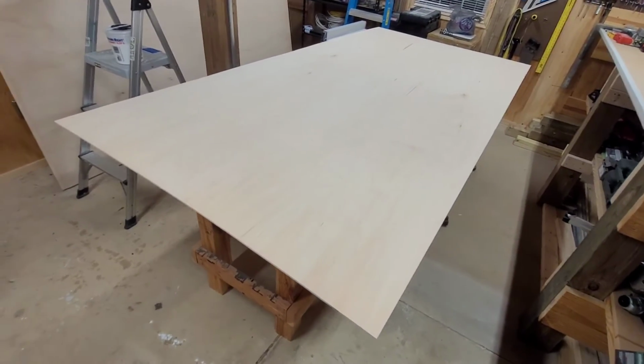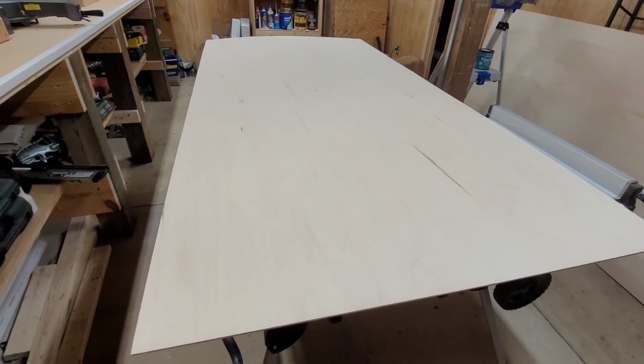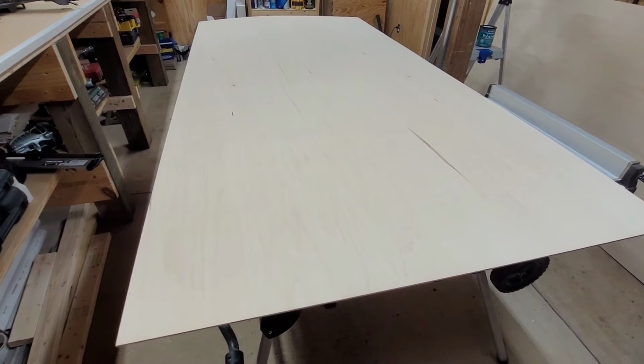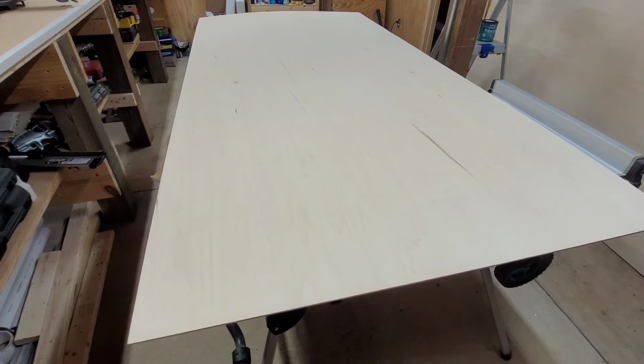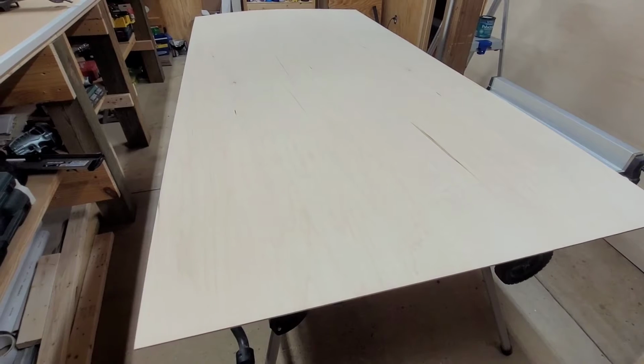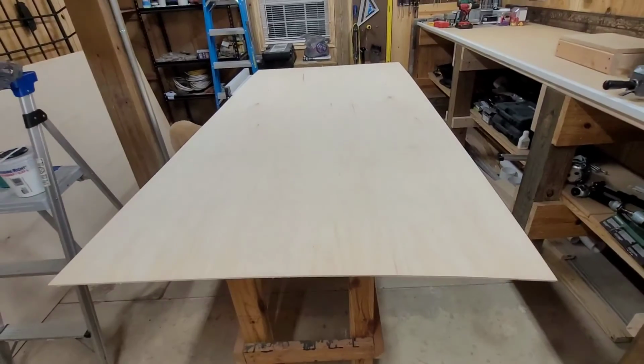We've got an 8-foot piece here, so to cover this whole thing and get it even is pretty difficult because you don't want the paint to completely cover. You want to be able to see the wood grain. So I'm going to try something different this time. I'm going to try applying it with a sponge. And rather than put paint on the wood, I'm just going to dip the sponge in the paint bucket and then smear it on, and hopefully I'll be able to wipe it in a more even fashion. So see how that turns out.